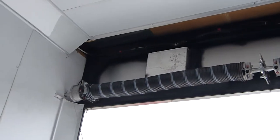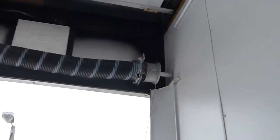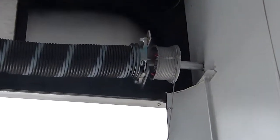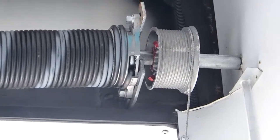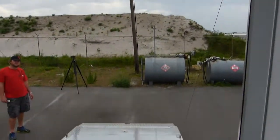This is a dual spring system and you can see the rollers on the end — this is where the cable rolls up into. There are two bolts that actually hold that wheel in place, so the safety is: if one came loose, you have the other one. The door would come down, but not nearly as hard — a person could probably survive that.